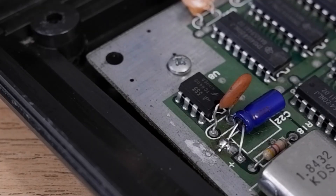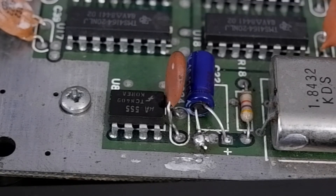The Plus 4 is a fairly simple machine and I can work around it. I've got all fresh caps on the board — not necessarily in the neatest order, but they are on there and hopefully there's a little bit of B-roll to explain what I've done. I will be picking up a new desoldering station very soon because a €20 desoldering pump that is an iron and a pump just doesn't work. Anyway, back to the fun.